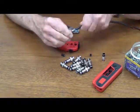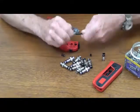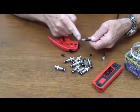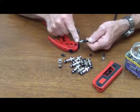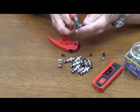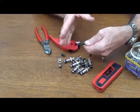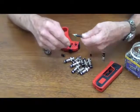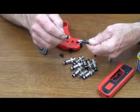Then I'm going to rotate that foil down real good, so it doesn't get trapped in the ferrule and so it goes on easy. Now I'm shooting blind. I know that I need to cut that center conductor at 3/16ths, which is about right there. I always like to cut it on a little angle, because that way it catches the flare of the pin and goes up easily for insertion into the pin itself.